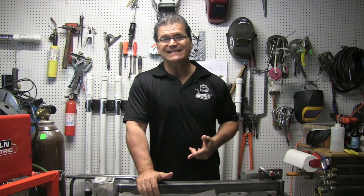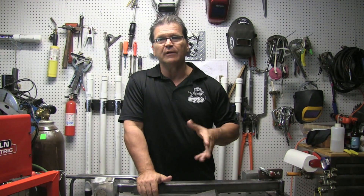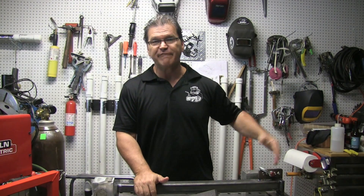This week's video is part two of a series on TIG welding machines. In part one I talked about mainly scratch start and lift arc DC TIG welders. This is part two, talking about AC-DC TIG welders today, so you can weld aluminum with these as well as steel. All of them have little features, nuances, drawbacks, pros and cons. I'm talking about four different TIG welders today, and after this I've got several more to talk about for a part three.